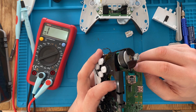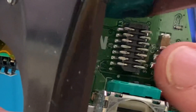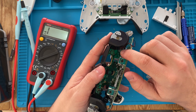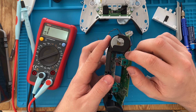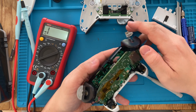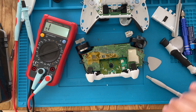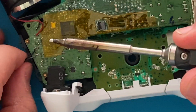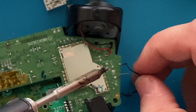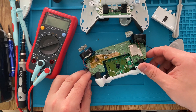This connection looks kind of dirty — the metal contacts don't look that great. I think we should probably take out this board just because those contacts were dirty. Maybe something was spilled in this. So to do that we're going to desolder these connections here. We're going to desolder this now — that was pretty easy. Now we can remove the board.